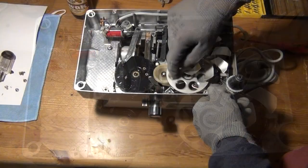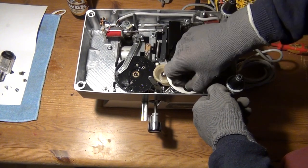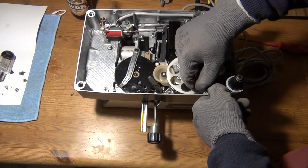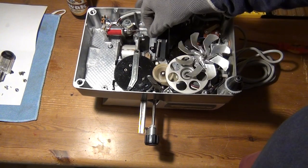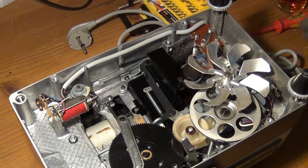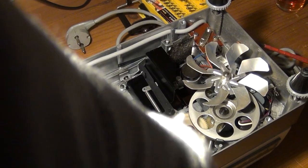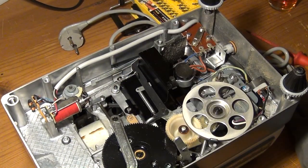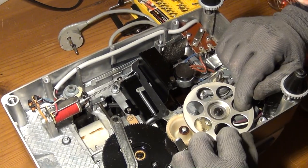So you can see here a display of very expensive production methods, even for a basic unit. And I guess that this unit was made in the 1960s. And because the light bulb is emitting a lot of heat, it was necessary to actively cool this device. And for that purpose, they inserted a shaded pole induction motor, in German Spaltpolmotor, into the bottom of the enclosure. And they manufactured just a simple fan from aluminium sheets and put that on that motor's axle.